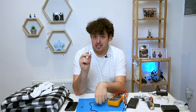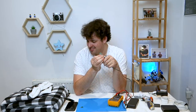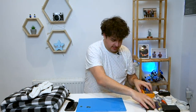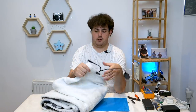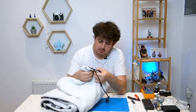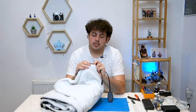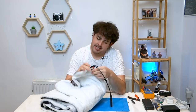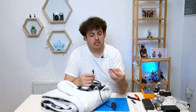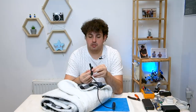So I've got a USB-C trigger board which can convert my battery into the 12 volts that this blanket wants. Now I need to connect this to the blanket. The two cables come out of a little plastic-supported piece here, and I can feel them go in and attach to the heater wire throughout the blanket. I don't think I want to take this apart because I don't want to get close to any of the heating elements. So I'm going to butcher the end of this DC connector and then try to attach the USB trigger board here, and then use a piece of heat shrink tubing to insulate it all.